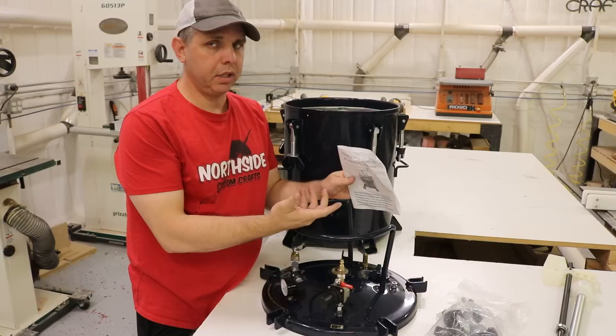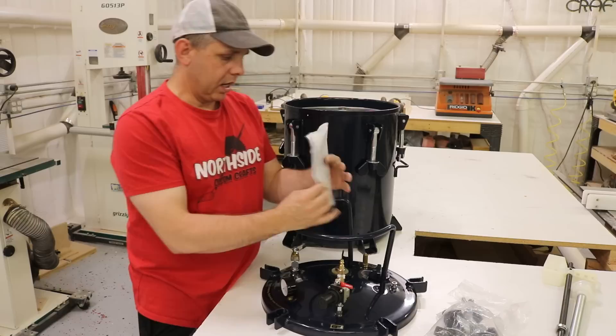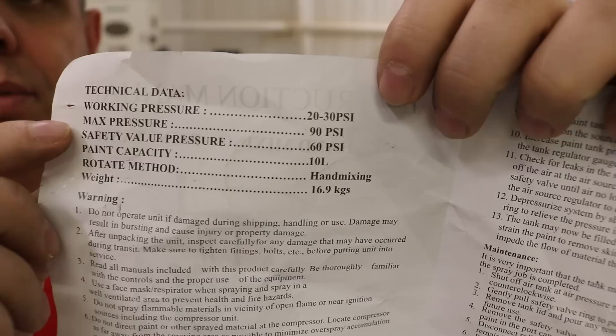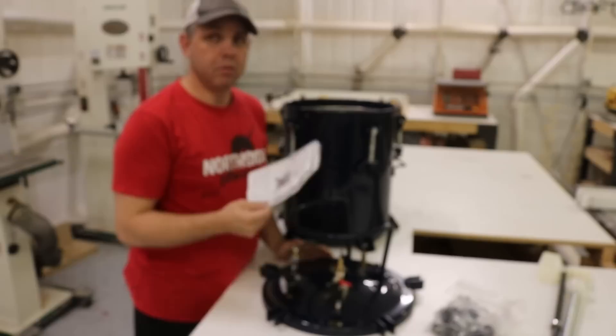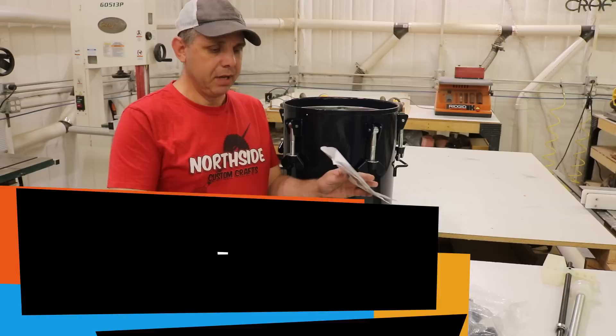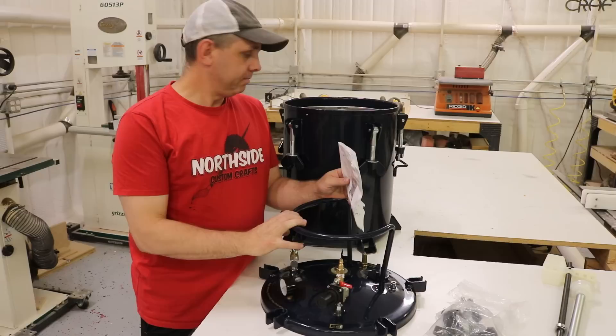Now one thing — this is a cheaper model, although I'm not afraid of its quality. It does have some discrepancies: online it says it's good to 60 PSI, on the lid there's a sticker that says 50 PSI, and in the directions it says max pressure is 90 PSI. My Harbor Freight one I run at 50 and it makes crystal clear castings, so if I run this one at 50 I'm not afraid of the pressure. Use your own safety measures in your own shop, but I'm pretty sure this is going to be fine.